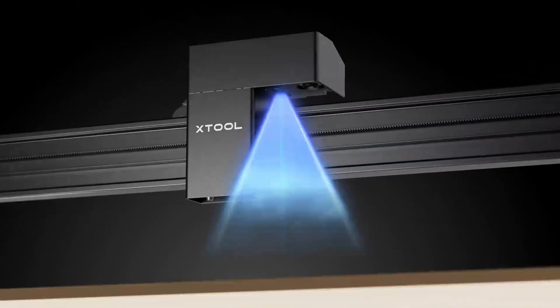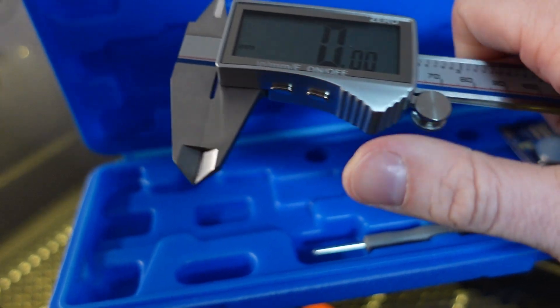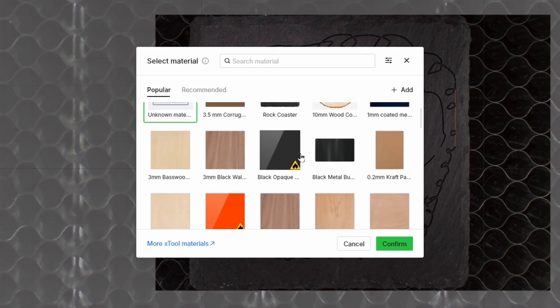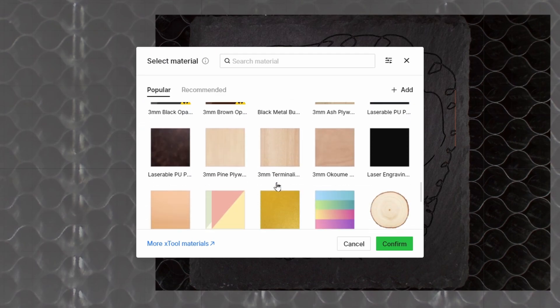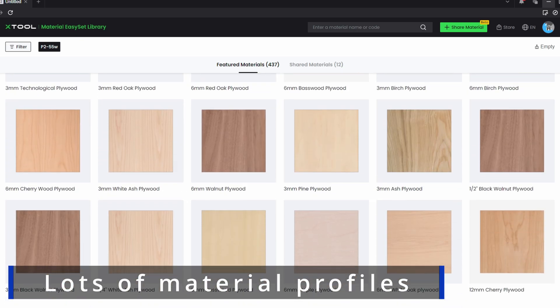The lidar ranging system is another feature I really like. It makes use of lidar to automatically calculate the thickness of a material — when you place something on the bed, the lidar can automatically scan it and accurately work out how thick it is. Being able to do this accurately really does save you a lot of time and saves you grabbing out your calipers. Inside of the Creative Space, XTool also provides a bunch of materials and presets for different thicknesses, and when you combine these preset materials, the auto arranging and the camera system, it makes for a really simplistic process even for beginners.